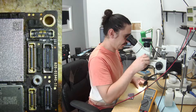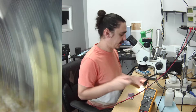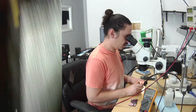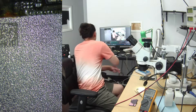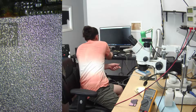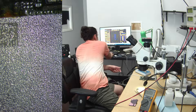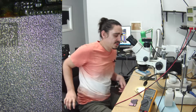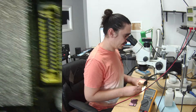I have no idea if it will work — I've never done this before — but I have already exposed the lines I plan on jumping. Volume up is the middle one, volume down is the top one. So I'll bridge the middle and the top one, and then I'll also have to bridge the power button.